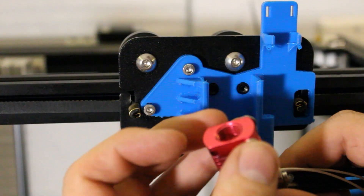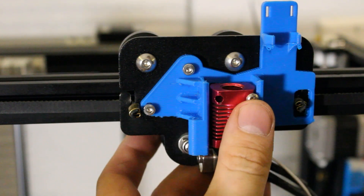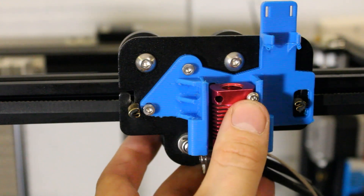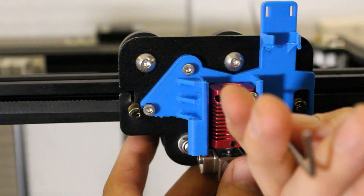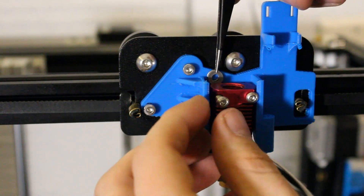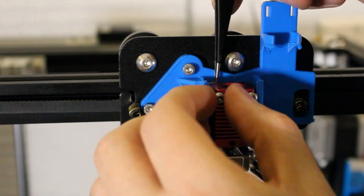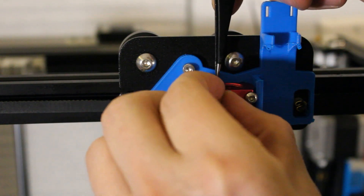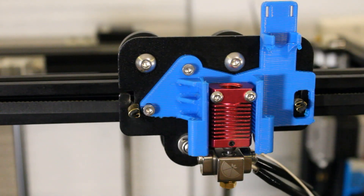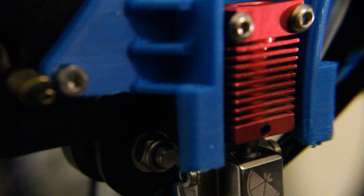What you're seeing here is just two 3mm washers that I use as spacers. The Copperhead piece extends out and touches that bottom tab, and I didn't want any heat transferring into that, so it separates it out by maybe half a millimeter putting those two washers behind it. You'll see me dropping two more in with a pair of tweezers. The only thing I really don't like about this Copperhead hot end is it was really close to the gantry.